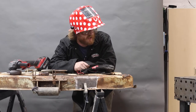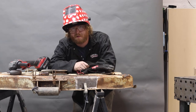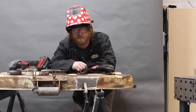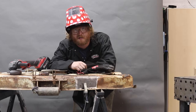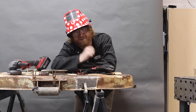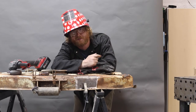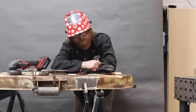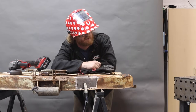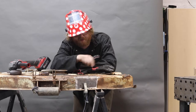We're going to grab our spicy glue gun. We're using the Hobart Handler 140, one of my favorite 110-volt MIG machines — a great machine that normal people own and use to repair lawnmowers. Today we're going with a slightly middle-grade helmet, the 2450 series Lincoln with the 4C lens. It's a really good helmet. We're going to use our grounding strap as our clampolator — it's holding it together so we can just put a couple of tacks in there. Got my settings set to 4 and 50 because that's what the machine says, but I don't believe that's high enough and we're probably going to crank it to 5 because personally I know this machine likes to run a little hot. We've got some 75/25 Argon MIG mix because I'm not a big fan of flux core.